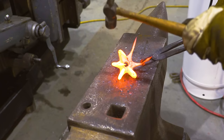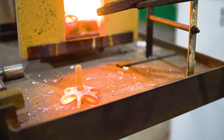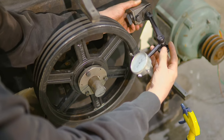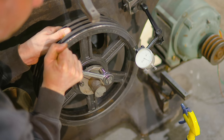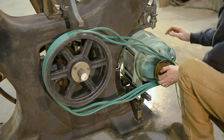I made a few more six-legged dead spider knobs to hold this guard in place. I'm checking the belt pulley for runout with the dial indicator. This is going to help with bearing and belt life, and also keep the vibration out of the machine.